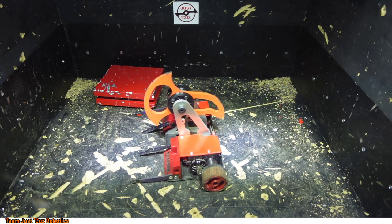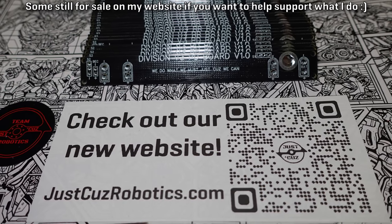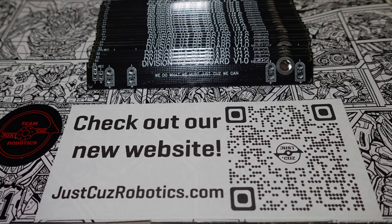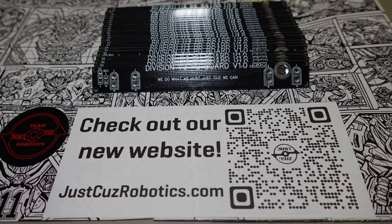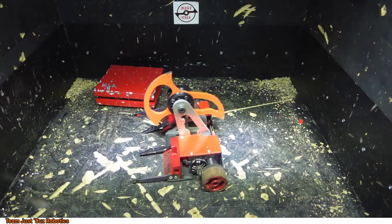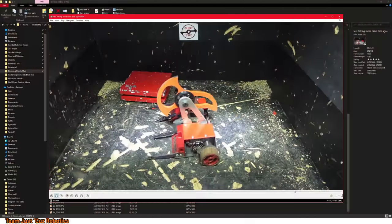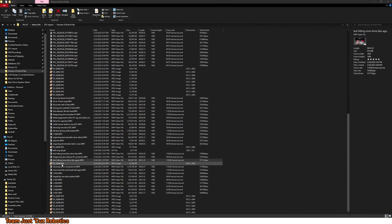The issue is the signal wire for this drive speed controller has to get to the receiver, which is on the other side of the robot. So I have a signal wire running to my PCB, then the PCB carries the signal wire over here, and the signal wire goes to a 3-pin connector here to there. The 3-pin connector on this side, though, is horizontally sticking out on the top of the board, and the battery was slowly crushing it and pushing it down and down until the solder joint broke from that 3-pin connector. So to fix that, I just decided to solder on some short wires onto there, just like I'd done with all the other XT30 connectors, because I was having those bouncing out whenever the bot hit something like a wall, and the shock load would push it straight backwards.